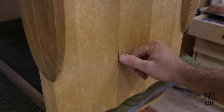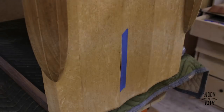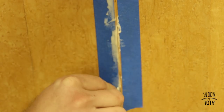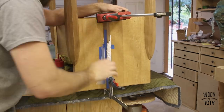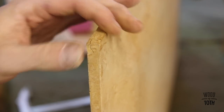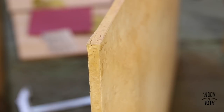I've got a spot right here where the veneer has lifted up, so I'm going to glue that back. There are also a few spots where the corners have just been dinged up from moving it so many times, so I'm going to sand it, put some super glue in there, and just smash it back closed.